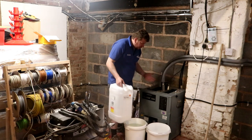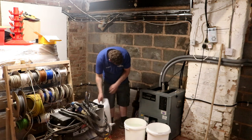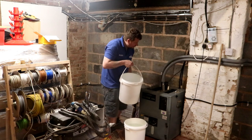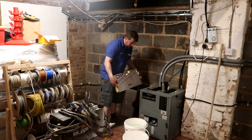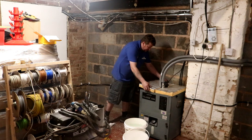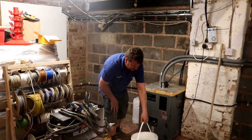The other two cold rooms can stay at 8 or 11 degrees. We'll store all the hops at around 5°C and all the beer at 11°C. We'll set the value for this particular glycol unit to something like minus 2°C, giving a buffer of around 7 degrees lower than what we'll set the closest cold room to — so I think it should cope. There's the overflow pipe, so I'll just put a bit of cold water back in, then stick the insulation lid back on top.